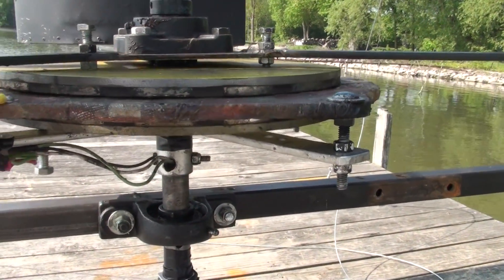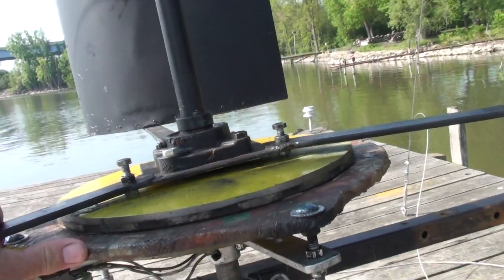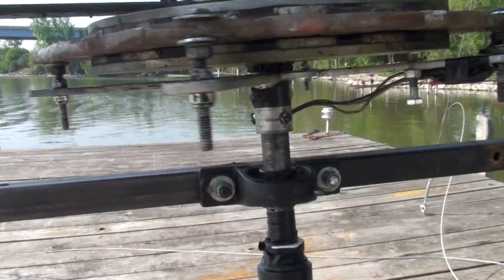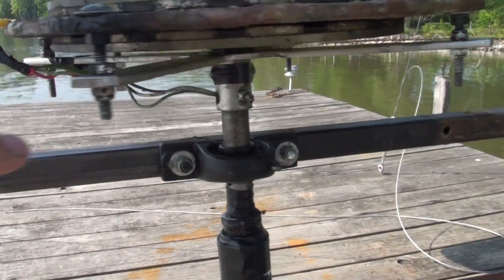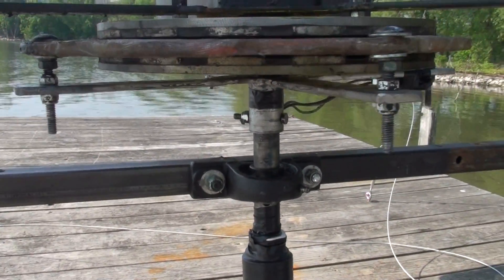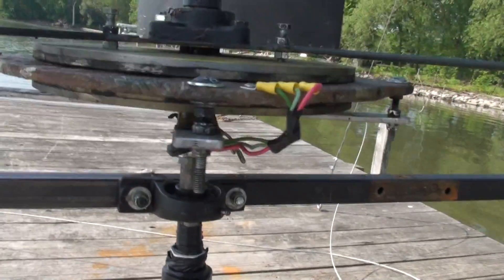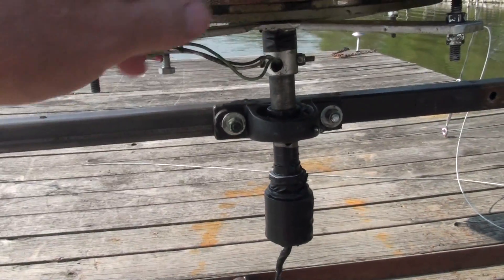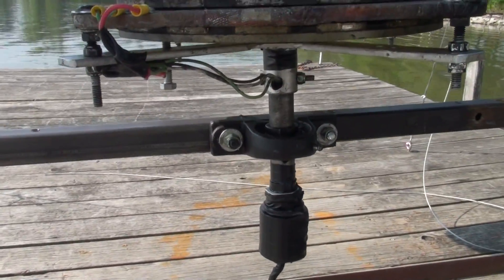So that when this is spinning — I'm going to turn this now — if this top wing section had wind right now, you can see that the stator mounting bracket is pinned to that shaft, which is connected to those top wings. This one turns this way and this one turns this way. If these aren't perfectly true or very close to it, you're going to have some rubbing here that you're never going to get out. Because of the counter-rotation it has to be pretty fussy.